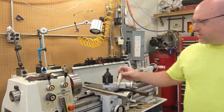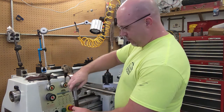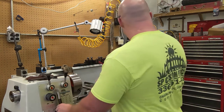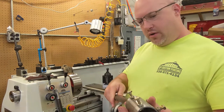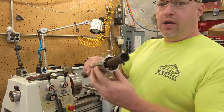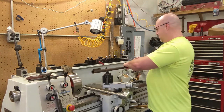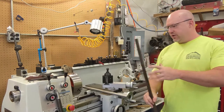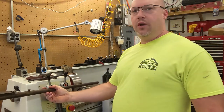Now, if your shotgun has a lug on the barrel where you can't fit it back through the lathe, then you may need something that can ride on your steady rest like this. So you actually mount your barrel in here, screw it down, get it all nice and perfectly true, and then that rides in your steady rest on your lathe. But luckily on this gun, that wasn't required — it could just stick right through the headstock and we could go to work.